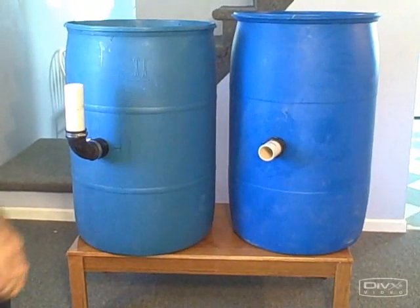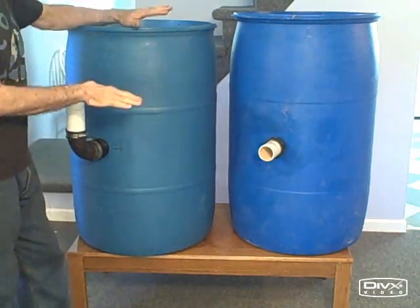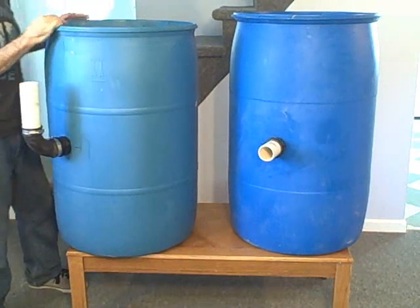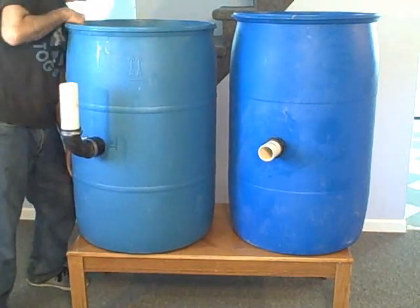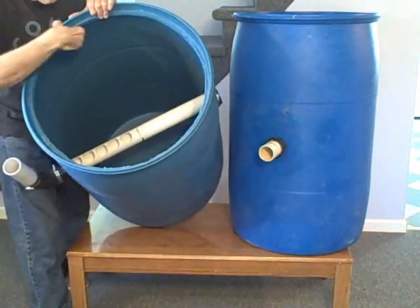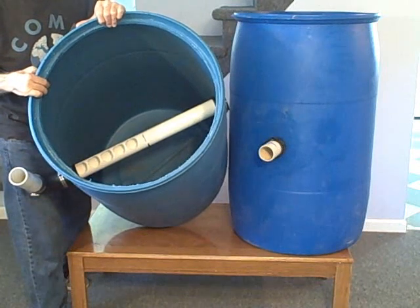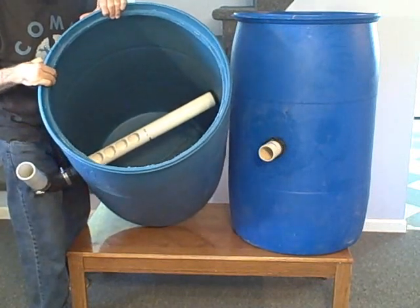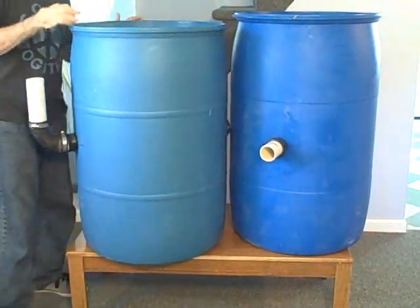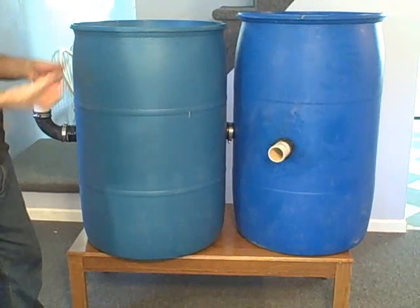We're all ready to connect our plastic tanks. Be sure to mount your tanks on top of a nice level platform, preferably a cement platform — make it nice and level so all your connections line up right. If it's for domestic hot water, you're going to want to install a PEX or polyethylene tube inside to extract heat for your domestic hot water. If all you're using this for is home heating, you don't even need that — you just collect the heat in these tanks, put them in a storage vault, blow air across them, and you'll be collecting the heat.